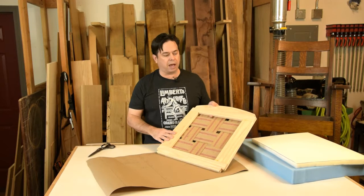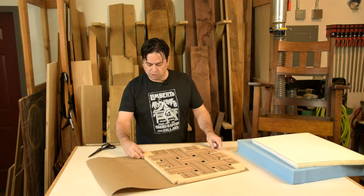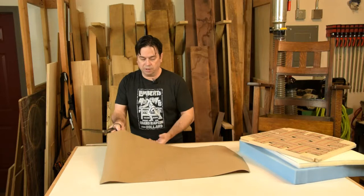We've got our seat frame built — a hardwood frame made out of ash with half-lap joints and jute webbing on top. We use this to draw out our template for the top panel. For the leather, stay a half inch beyond your line and leave a little extra at the front for where the cushion waterfalls down over. We'll finish cutting out that template and then cut out the leather panels before heading to the sewing room.